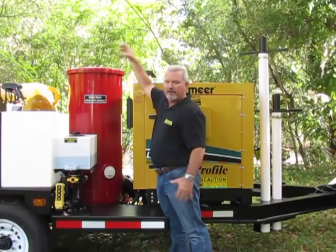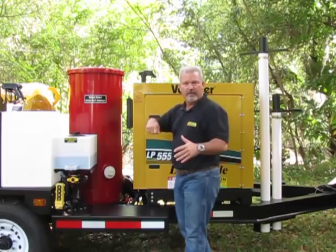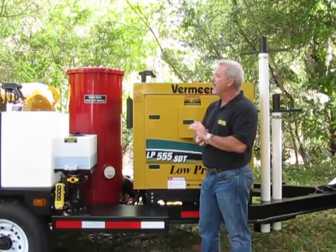You have three wing nuts inside there that allow plates to move over so the filters come out easily. Pull them out and clean them with either the low pressure water wand or air. Be very gentle with the filters. They're made out of polyethylene material, but they can rip. They will last a long time if you take good care of them.